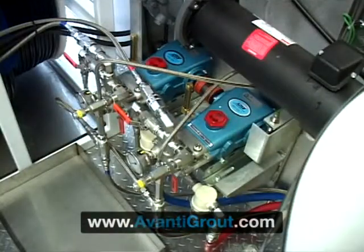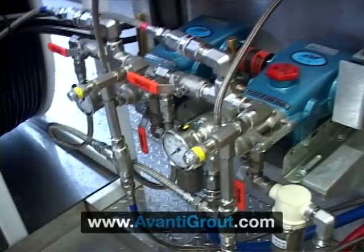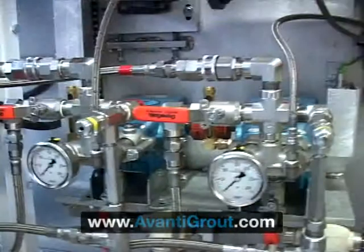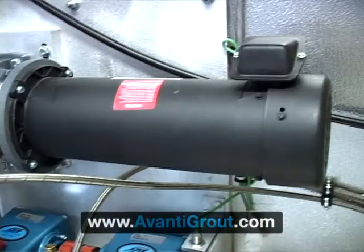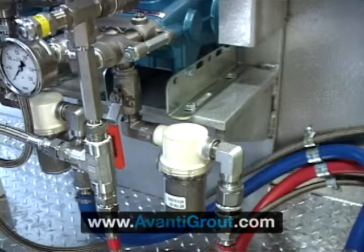Tell me about your pump system here. The pumps are really the key delivery device. Two things are important with chemical grouting — we have to saturate the soil, meaning we've got to get a lot of chemical out into the soil before it starts to gel. We use stainless steel positive displacement pumps driven by an electric motor, variable speed with reduction gear. We're basically able to recycle, bypass, and we have a pressure relief valve system.